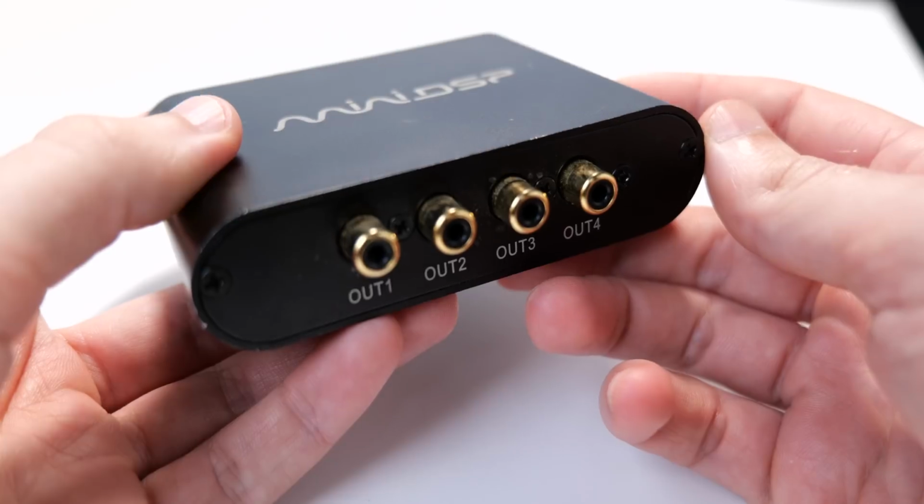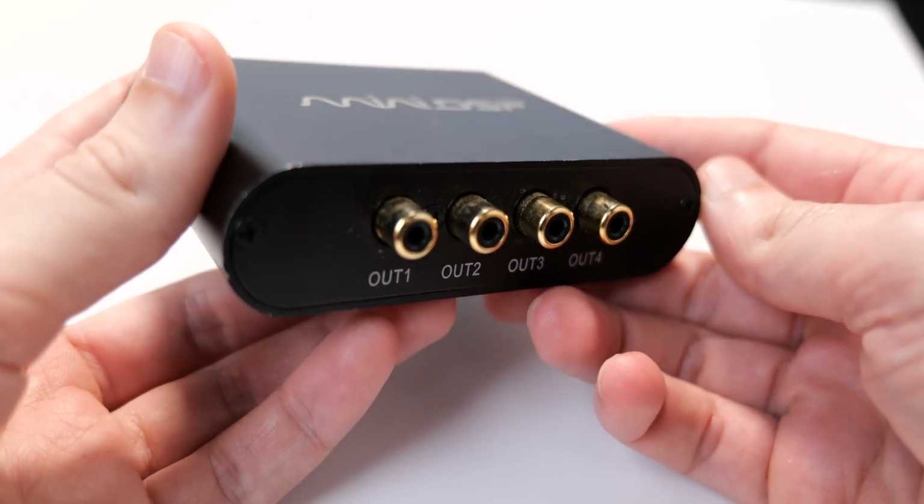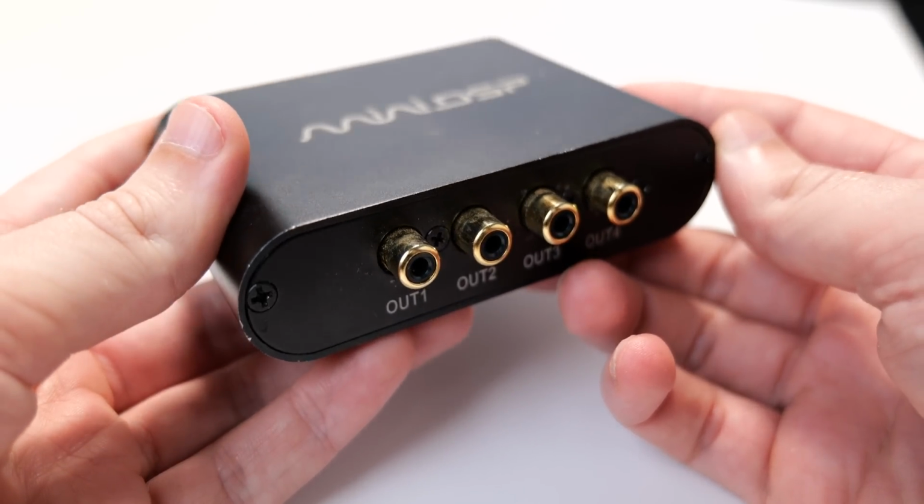And the solution I eventually found was to actually stop doing that and cross them over. I mean, I still use DSP, but the inner speakers did the mids and the outer ones did the treble. This made DSPing each set of panels much easier because instead of having to focus on all the flaws of full range, I could focus on just the individual flaws in the treble or mid range.